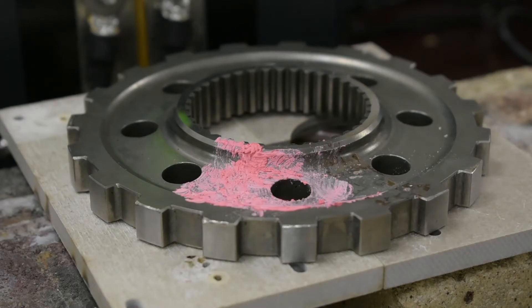The heated material is magnetic steel and the required temperature is around 110 degrees Celsius. The process requirements for this application test are two: we have to reach a max heat cycle time of 100 seconds, while the whole duty cycle between heating cycles must be 500 seconds. One more important goal is to heat the part as uniformly as possible.